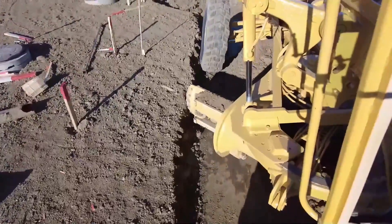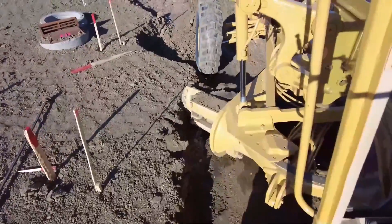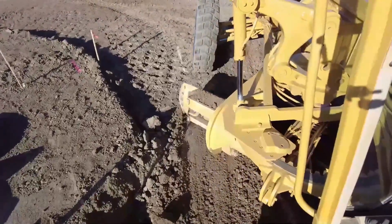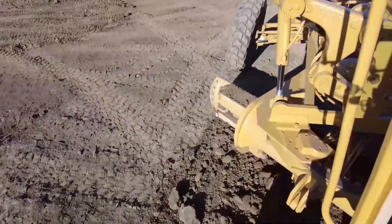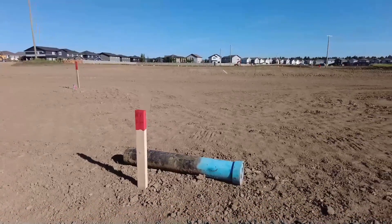If there's no backing there, when you're trying to pack that edge of the gravel, it has a tendency to keep going away on you. It's just perfect to have a 20 or 30 centimeter little edge right at your line there. It just works out good.